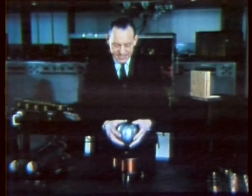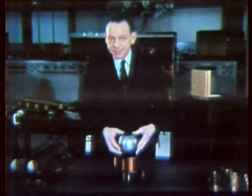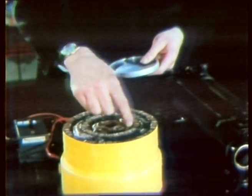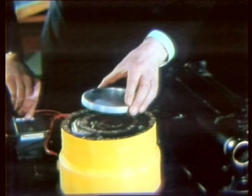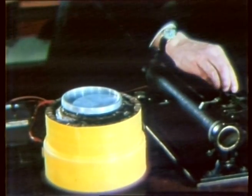Now whilst it's reasonably easy to support a three-dimensional object such as a sphere, you have to be more careful with a flat plate. But it is possible to support a disc such as this one. Again, we have two coils, one inside the other, and this time each coil is wound on a laminated steel cylinder. When I switch on, we can suspend the disc, and if I now control the current in one of these coils, I can make the disc do different things.